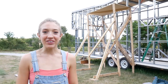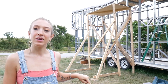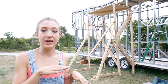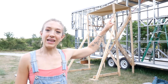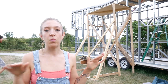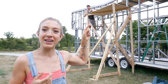Our scaffolding design has changed a bit since last time. We ended up adding four 2x4s — these outside triangle pieces help widen the base, and they're also adjustable because the ground is a little uneven, so we can move them up and down to help with stabilization. We also added one more 2x4 up on the scaffolding platform, because when there are two people on it it starts to bow in. It creates more even weight distribution — even though it's a little more ghetto fabulous, it's a lot more safe and sturdy.